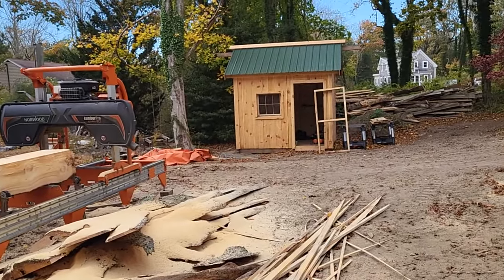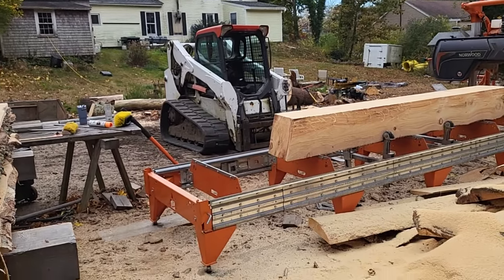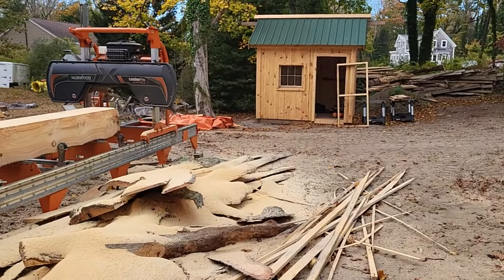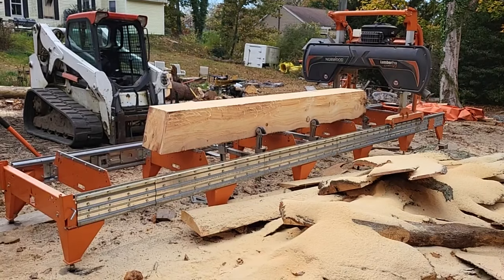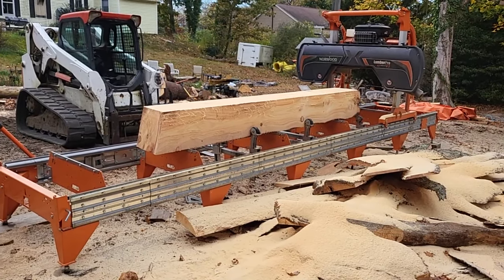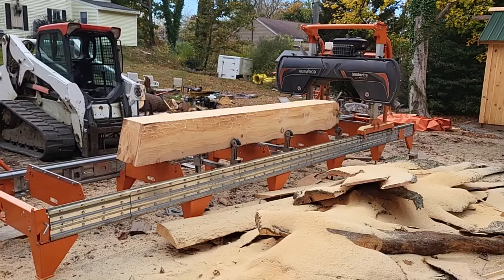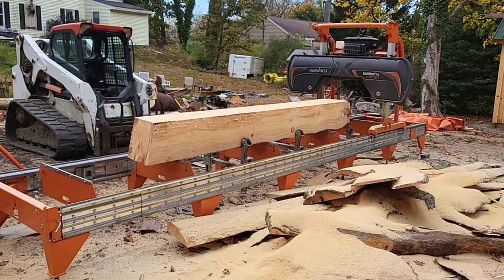So I do need to skin that shed door, but I only need 30 inches. So at 7 wide, that would only be 5 planks, and one would have to be ripped. So I'd probably put the rip one in the middle. So that's not many planks. So maybe I'll keep one half of it. Something's going to end up being battens, and that 9 dimension works out great. If I wanted to cut it into 3s, a 9.5.